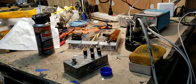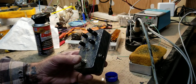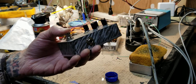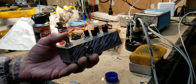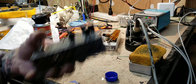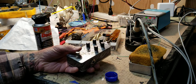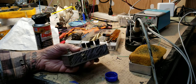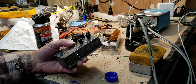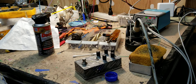Anyway, hope that helps. That'll fix most issues with signal cutting out — even in bypass. If you're bouncing that plunger without clicking it and it seems to bring the signal back, it's probably just dirty contacts. Chances are your footswitch will last you the rest of your life. I use mine every day — 25 to 50 clicks on each of my pedals — and I have some I've been stepping on for 12 to 15 years with the original footswitches still in them. Have faith in those true bypass 3PDT switches — easy to replace, and they last a hell of a long time.